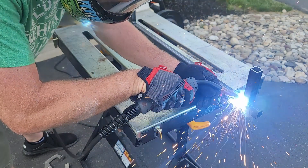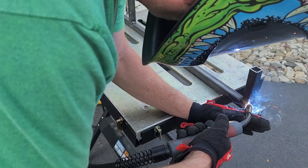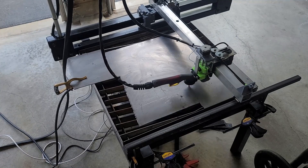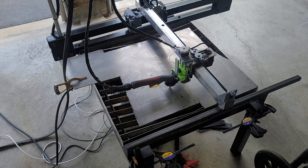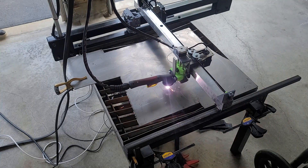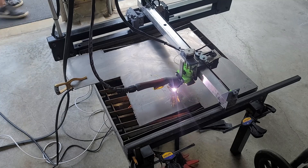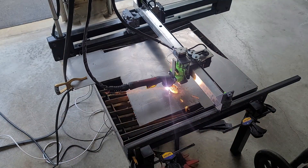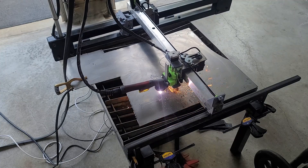With the railing welded, I can reattach it and let's get to cutting. When you see the torch get into position, you'll see the torch lower, touch the metal, then come up — this is the optional Z-axis touch-off I mentioned. This will repeat itself on every cut. The nice thing is that if you have any difference in height in your material, this should pick up on it.